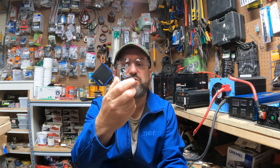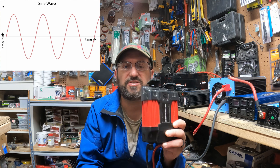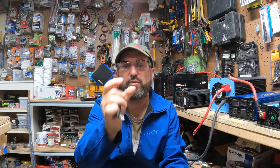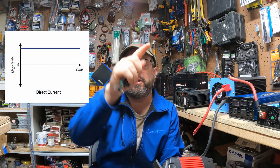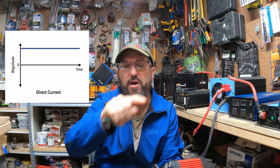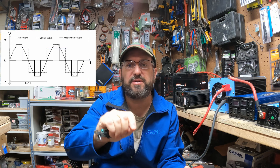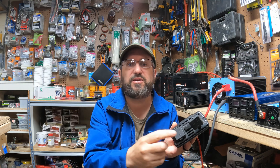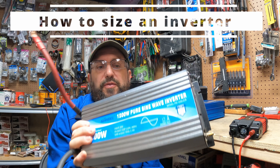It's not a big switch like one you'd use to turn on a light — it's a small switch. Because it's alternating current, it goes up and down. What the inverter does is turn on and turn off that DC energy, flipping it back and forth. There are a bunch of these switches in there. It takes that straight DC and turns it into a square wave, and then other components turn that square wave into a sine wave, so on the output you get AC energy that's usable in your house.